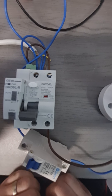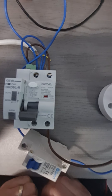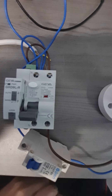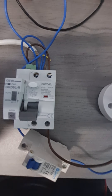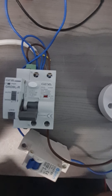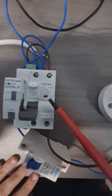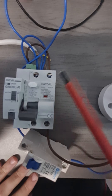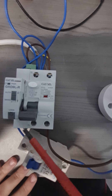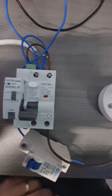However in our opinion it could still pose some issues related to maintenance, and it does not have the features offered by premium brand devices. Obviously there is the possibility of locking the device when one is doing maintenance. But if such a unit is used — if it is allowable in your specific country — there should be a clear notice that the RCD recloses by itself, so anyone doing maintenance will know that such a situation exists.